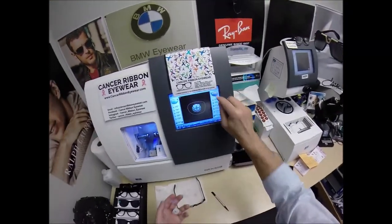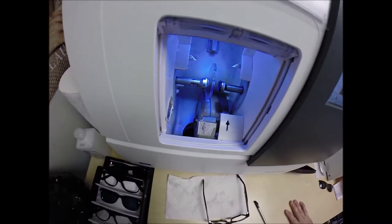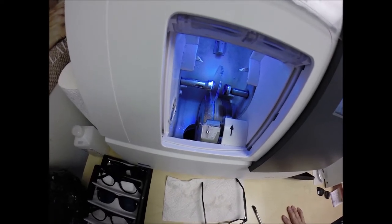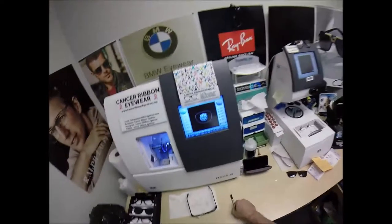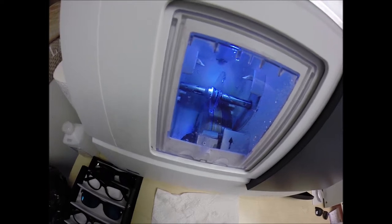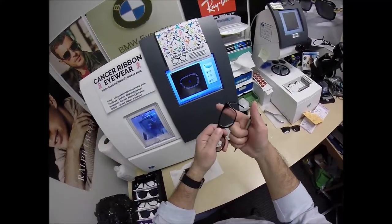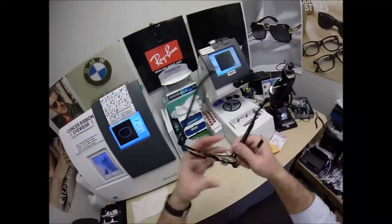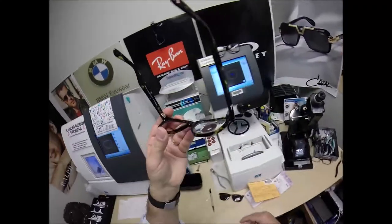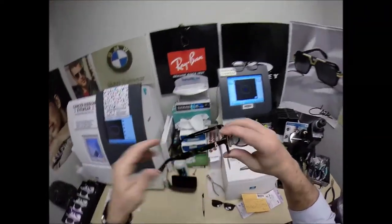We're going to flip this over to L, place the magnet into the chuck, hit the green start button, the door closes, the clamp shuts. The lens is going to be traced again by the two wide styluses, making sure it's large enough to fit into the frame on the first go-round. It's also measuring the thickness to know where to place the bevel for the least edge thickness. And Sharon — you have nothing. No edge thickness at all. All you've got is a beautiful pink ribbon on the side.